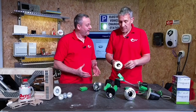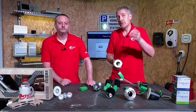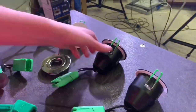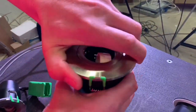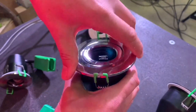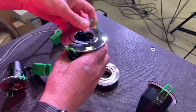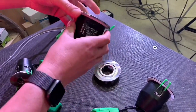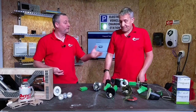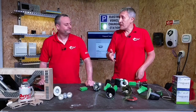The bezels are interchangeable — you can buy additional bezels if you want to change the finish in the future. Let's demonstrate swapping out the gimbal version: that's the brushed nickel, and swapping it for the chrome. How simple is that! You can also change the angle with the gimbal mechanism. Note that you can't exchange a gimbal bezel with a non-gimbal version because the can is slightly wider on the gimbal. You just flip them out and change them over, and you can remove the bezel when decorating.